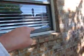We're at the left elevation now. This is the window inspection. You see here, this window here has considerable rot on the trim work. The caulking is failing. The trim above it and the siding is almost certainly leaking. And the window above us is also going to be leaking in heavy rain. It's going to go straight into the property. There's nothing to stop it. And water just goes where it can at any time.